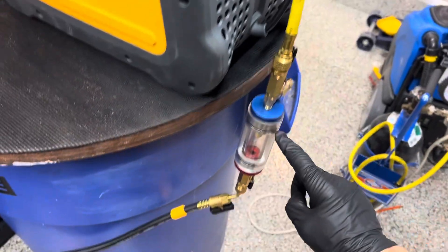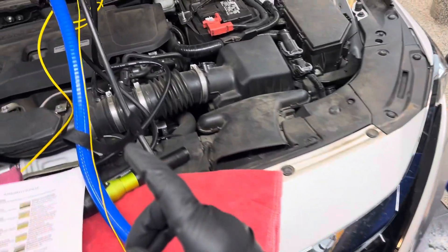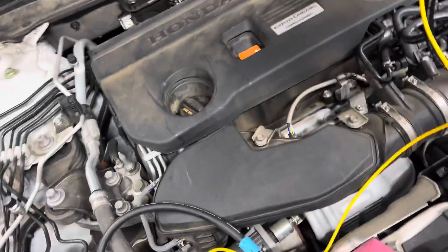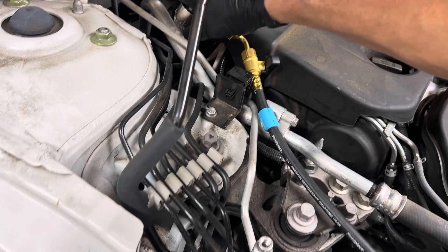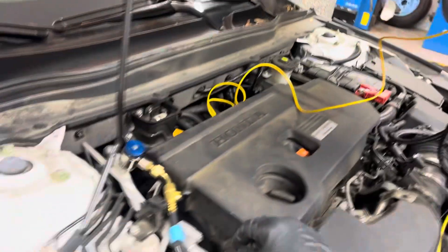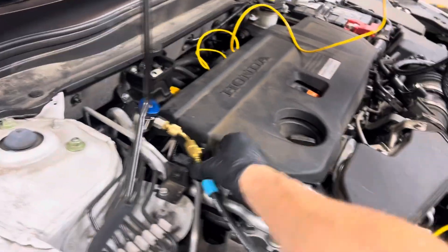This is under a vacuum. I'm going to show you if oil comes out. The idea is you don't take refrigerant out of the liquid because you don't want to remove oil. You remove it out of the vapor slowly. We're going to have both sides on but only take from the low side first, until we drop the liquid side down to a vapor pressure below ambient so we know we only have vapor. We already have refrigerant in here — 29 and 108 — from when we used it earlier on this same vehicle.